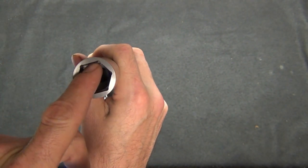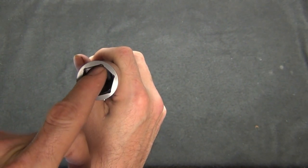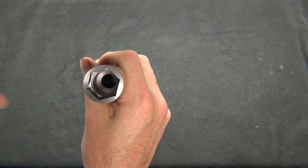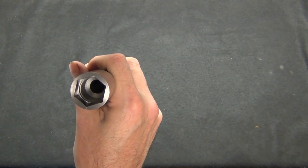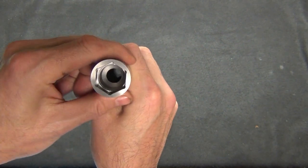So what I did is I pushed the tangent of the end mill I was using out to the theoretical sharp corner of these intersecting lines. That allows you to put a hex tool in there that would have sharp corners. Now, the tool that he has actually had flats in the corners, but I couldn't measure them, so I just put in full clearance on each corner.